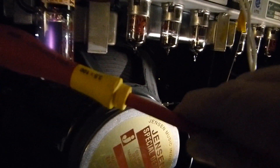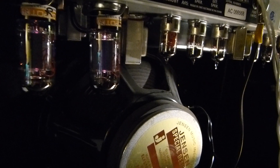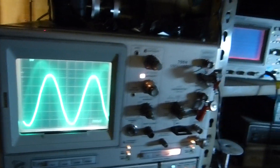Its power has dropped to 2.9 watts. I'm going to thump it to the right now. There it is — see, the red went away. I made a good connection again. I'm pretty sure it's pin 5, the grid, so it was losing its bias voltage. And there, its output is restored.